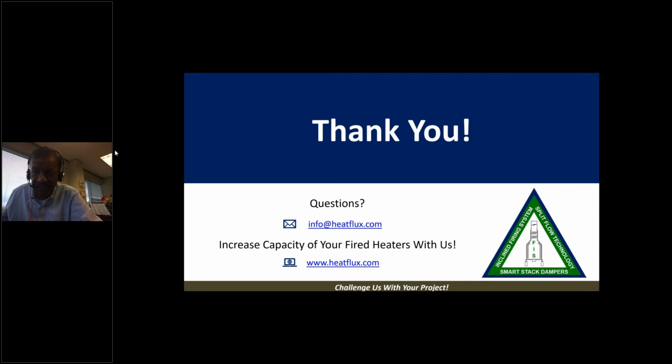So the next question we have is, wouldn't the additional tubes in the convection section affect the draft of the furnace? Is the furnace stack damper enough to maintain the draft with this technology? Absolutely. So we do a complete re-rating of the furnace and we want to make sure that any additional surface we add, you still maintain enough draft in your heater. So the heater is completely re-rated. It's not just the convection section. We re-rate and make sure the stack, the burners, everything is working. So good question, because convection section, we can always increase the width.